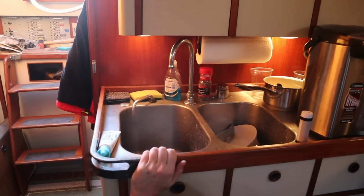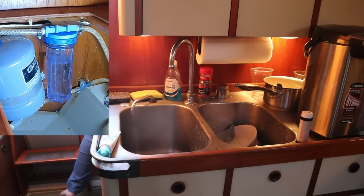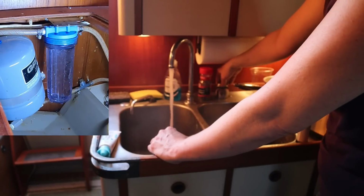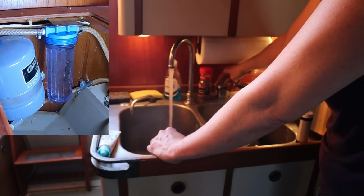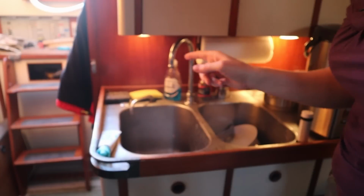Let's open up all three tanks and let's go turn on the pump. Okay. That definitely still had some antifreeze in it. Now I am going to hook up the hot water tank before I shock the system, because I want to make sure if I left any water inside the hot water tank, it didn't have a chance to start growing anything. So that's done.